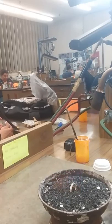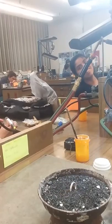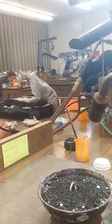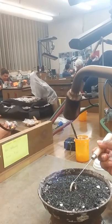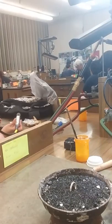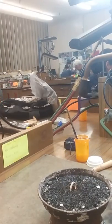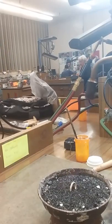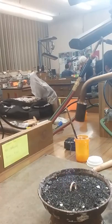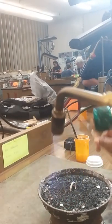Looks like it's about to go into the seam soon. No, don't do this to me. I know, I came out of the video already. But it's only a little bit that looks like it's gonna go into the seam. Yeah, my fire's up too high, guys. My seam also may be too big, because I can see through it clearly. I'm gonna see if I can move this over some.